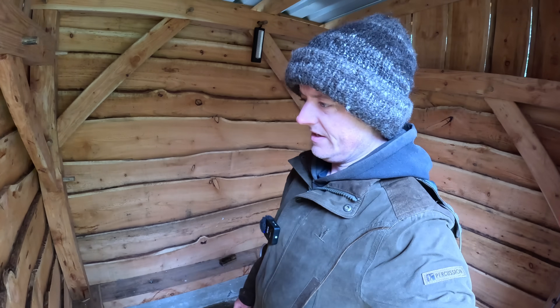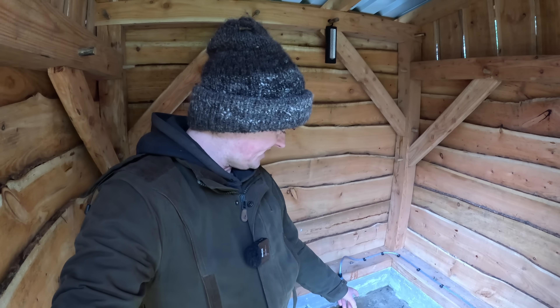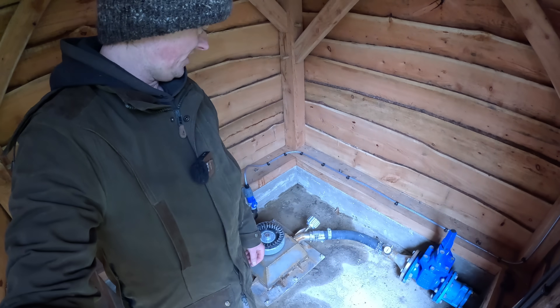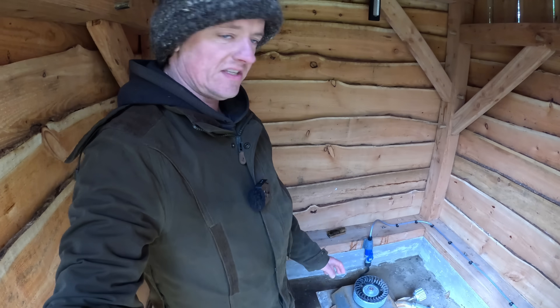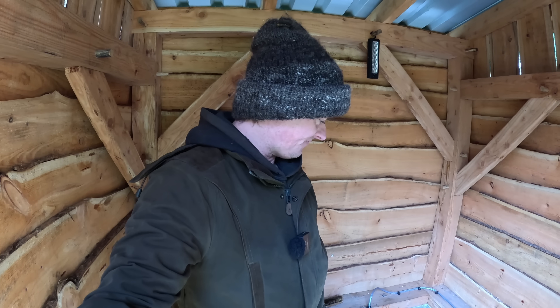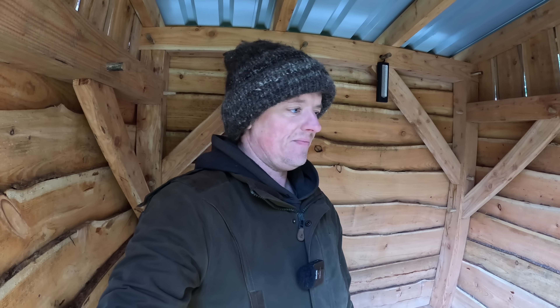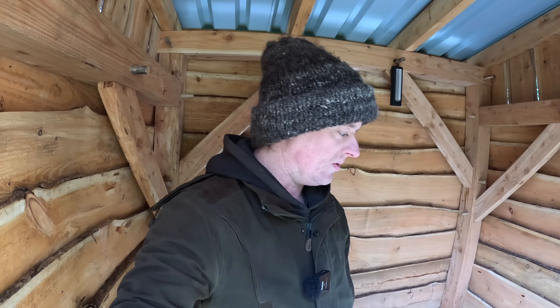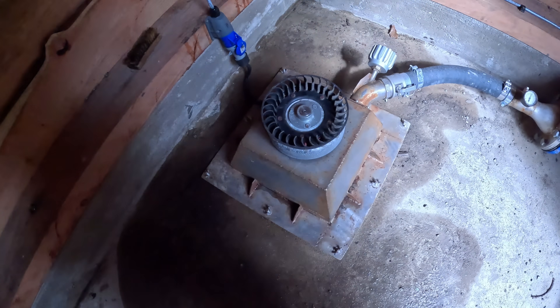A few of you have probably noticed the title of these videos has been '1.5 kilowatt turbine' — the reason for that is because that is the goal. That nozzle is a prototype and I'm still working on the final version. Once I get the final version, it's going to get a slightly bigger nozzle on it for this job to get a bit more power. The customer doesn't have a huge amount of water, but after the couple of years he's been running it, over the average he thinks he can sustain a little bit more water, so we're going to put a bigger nozzle on it once it's complete.